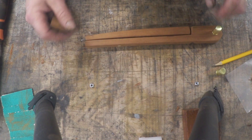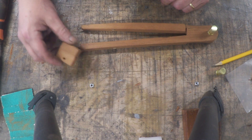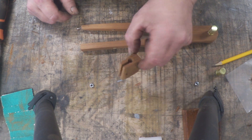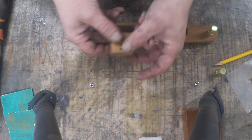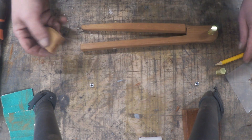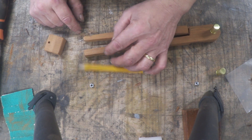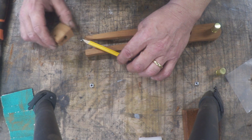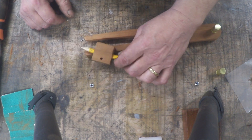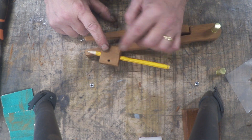It's a nice project — it's quick, it's easy, and it gives you a pretty, useful result. It's just about finished: shaped, sanded, needs a bit of oil, got its pin in. For the pencil holder, I've taken this extra block of mahogany, drilled a 7.5 millimeter hole, cut a slot, and then drilled a 4 millimeter hole where we're going to put the bolt, so the pencil can get cinched in place. It's best if the pencil lead points towards that point — some sort of angle like that would be ideal — but this is meant for drawing big circles so it doesn't matter that much.